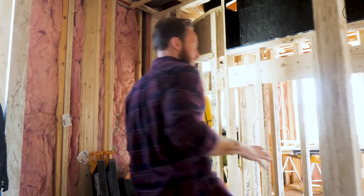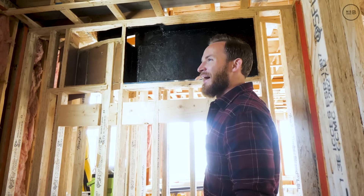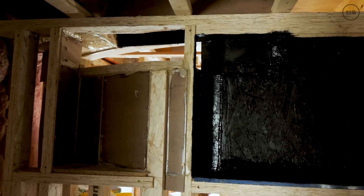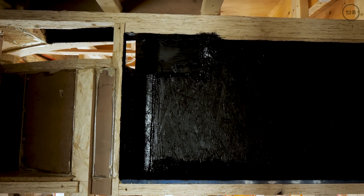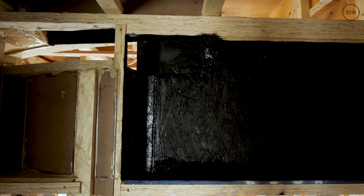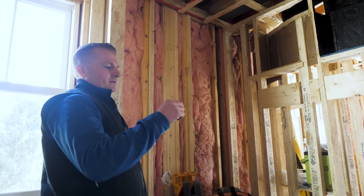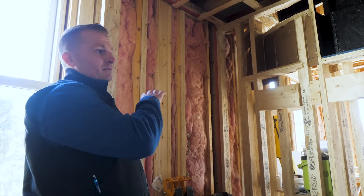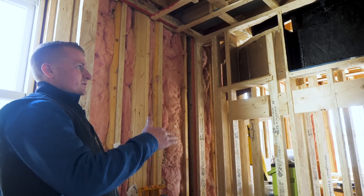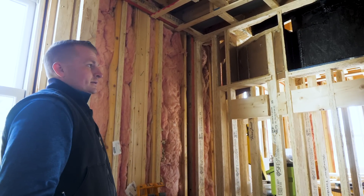Their calculation netted us with a specific grill size on the bedroom side. If you flip around to one of the closets, you can see it ended up in a position with no cabinetry, nothing in the way, hidden out of sight making almost a direct shot back to the central return air. In the closet, cabinetry is on both sides, and we made a giant box essentially to get enough air to come across. When plastered in, it's just going to be a couple of little slats up on the wall — a very clean plastered-in grill that blends almost invisibly into the space.